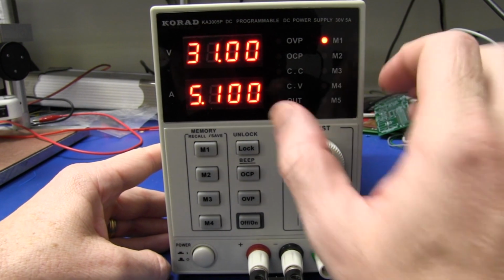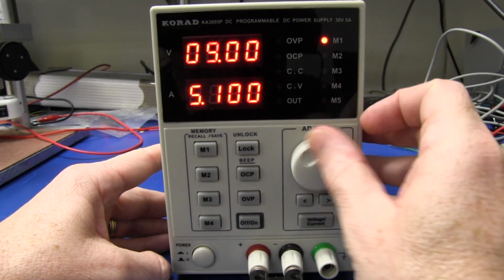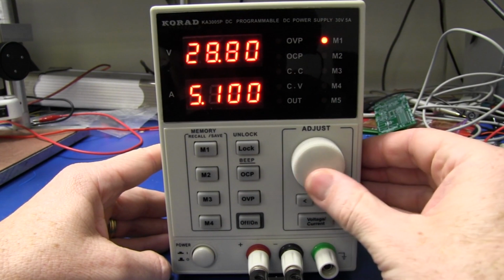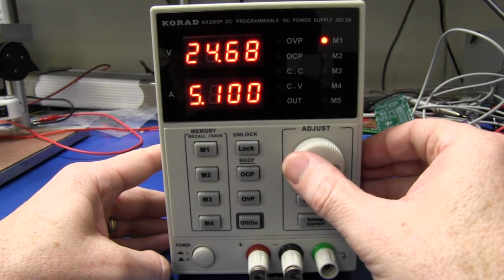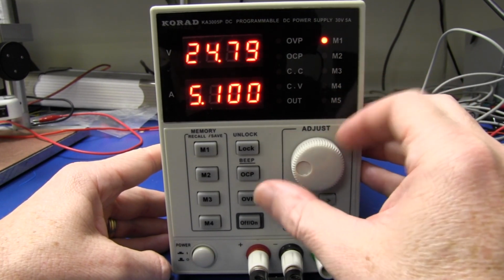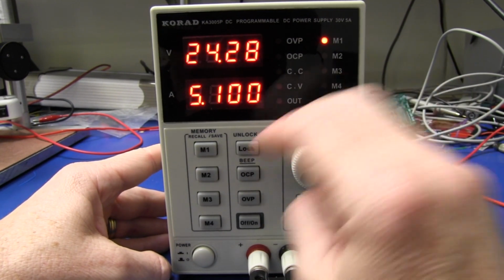So if we go in here, say 1 volt, we can adjust it like that, and it goes all the way down and operates on that 1 volt. So we can go over to here, 100 millivolt resolution, great, and we can go over here, 10 millivolt resolution. Excellent. I don't notice any missing or doubled up jumps there on the optical rotary encoder. Seems to do the business.